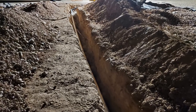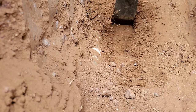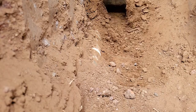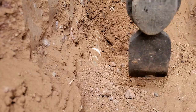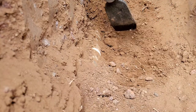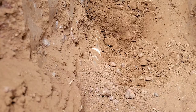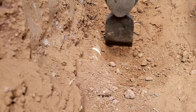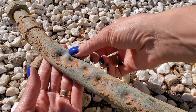Here we have an open trench we've dug out to replace our water service line. Looking at section 306.2 of the 2018 IPC, which is what our city is using for code guidelines, we have to over-excavate because, according to 306.2.2, we had rocks mixed in with the soil from the first time it was run or the last time it was repaired. We don't want to see repeat damage, as you can see from the old copper pipes we uncovered.